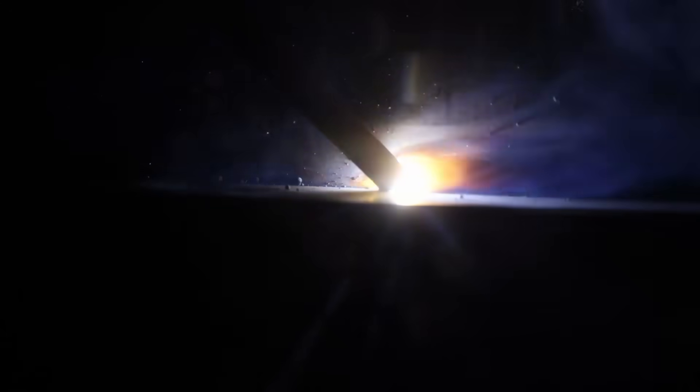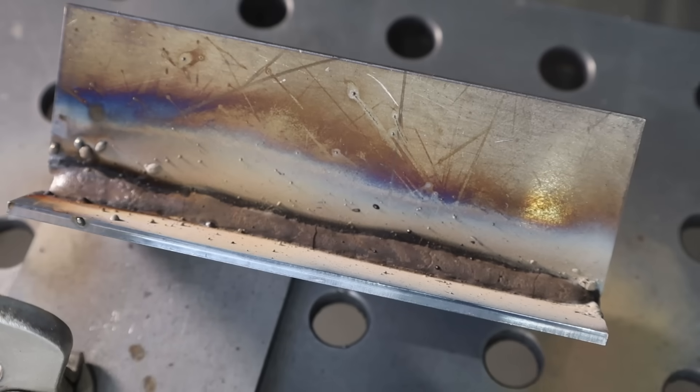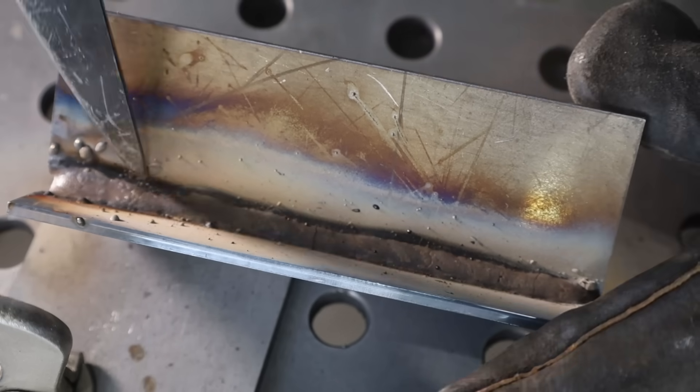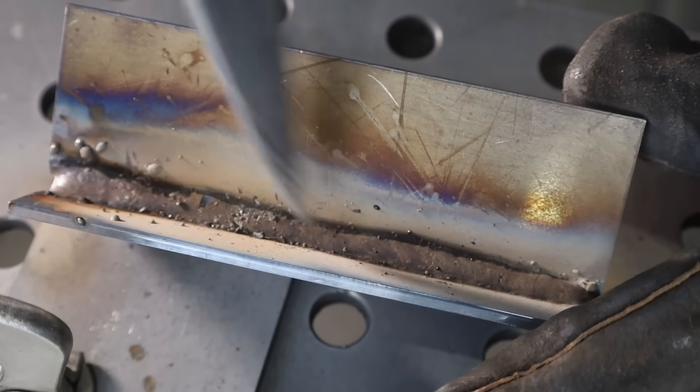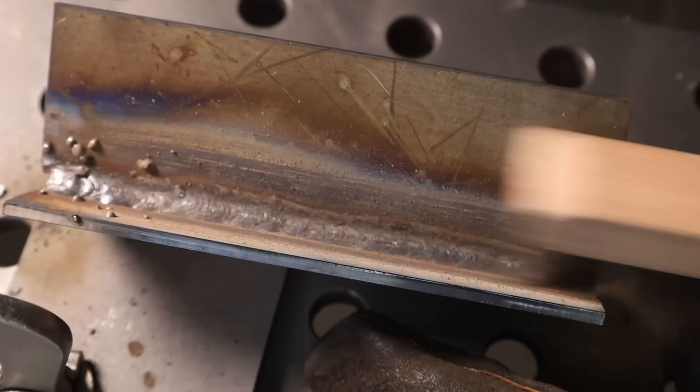You can see as I'm welding here the electrode is just maintaining a nice short arc because I'm moving my hand in closer to the metal as I move along. You've got that bright spot where it's really hot, it's depositing that metal in, and it's also burning off that flux and leaving a coating on top of the weld called slag. At the end of the weld you can see that slag coating remaining, and I'll go ahead and remove it with a tool called a chipping hammer. After I rake that off and clean it up, you can see I have a nice result.